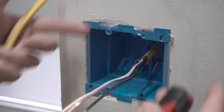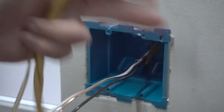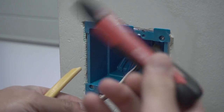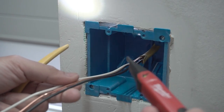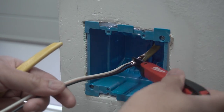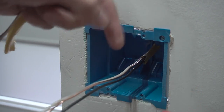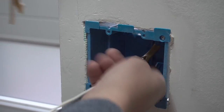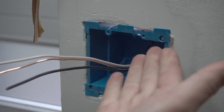Before you even start doing any of this, I highly suggest that you get one of these voltage testers. Turn off the power from your circuit breaker, test it out on a live wire first to make sure it's actually working and that you have full battery, then test if the wire you're working on is live or not. All the tools I use in this video I'll leave in the description down below. This extends one inch — you can cut a little bit more or push it back in and wiggle it into the entrance so that you have that quarter inch compliance per code.